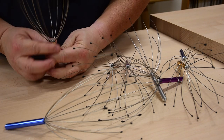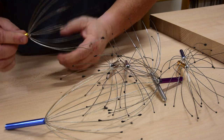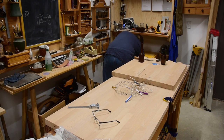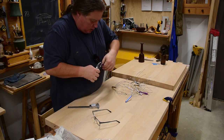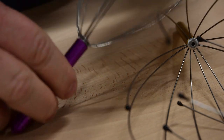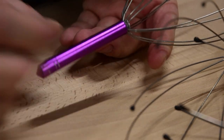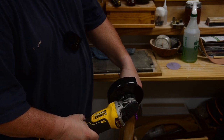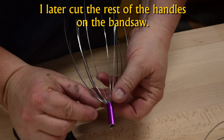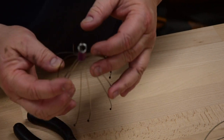It'd be nice if I could just take this off and use whatever is underneath it to make an even smaller hole, or maybe something a little bit shorter, because you don't need that much material for a handle. The question is how to get it off. Let me grab a purple one because purple is ugly. Can you just pull them off? Doesn't look like it. It's got a little rivet here — looks like it's the wires pressed in to attach it. Maybe if I cut this in half we can find out. They're pretty hollow and just have wires coming down to about right there. So I could cut that off and just drill a three-eighths inch hole into something to epoxy this in. That's our solution right there.